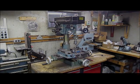Both hand wheels have dials marked in 1/1000th of an inch increments. The dials have numbers 0 to 100, so each full turn moves the table 1/10 of an inch. In the vertical dimension, the milling machine chuck can be advanced in 1/1000th of an inch increments using this hand wheel.